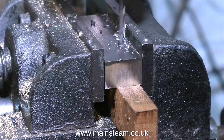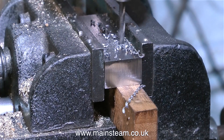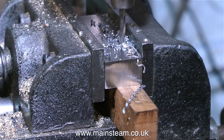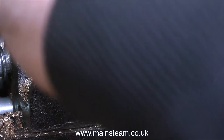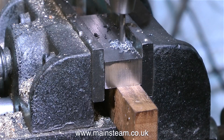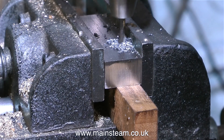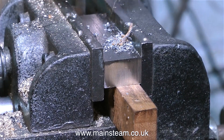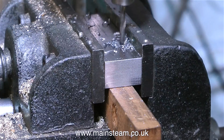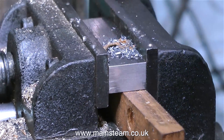There is another way, if you don't want to look in books or on the internet, to find a good tapping size drill for a BA or ME type thread. Here's an example that works for other sizes too. I'm drilling this metal block to take a 4BA bolt. Take your 4BA bolt and measure its external diameter with a micrometer or caliper. A 5/32nds of an inch twist drill will drill a hole that is a good clearance size for a 4BA bolt — it's a bit of a rattle fit. 9/64ths is almost dead on, but you don't want that. So: 5/32nds, 9/64ths, and down to 1/8th of an inch diameter — which is a good tapping size for a 4BA thread. That's 2 imperial sizes down from the clearance fit.